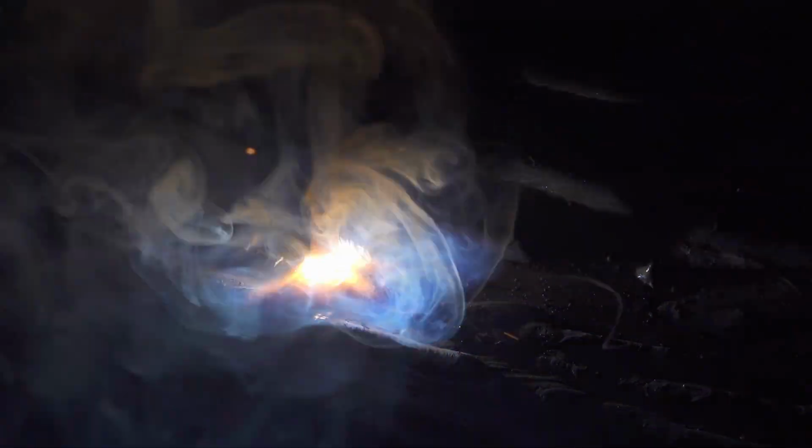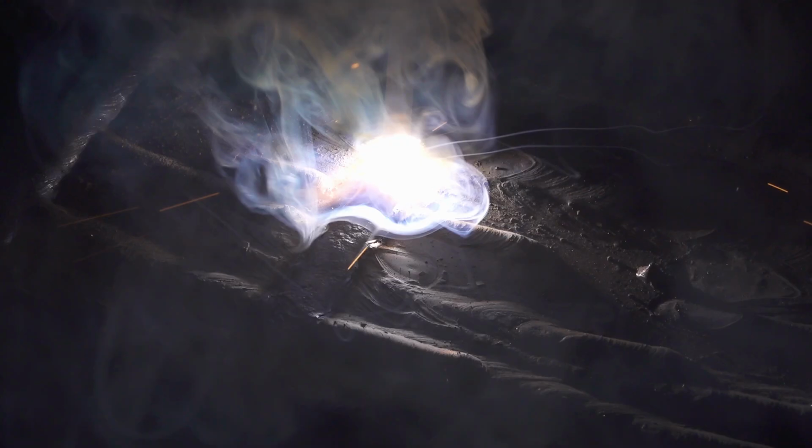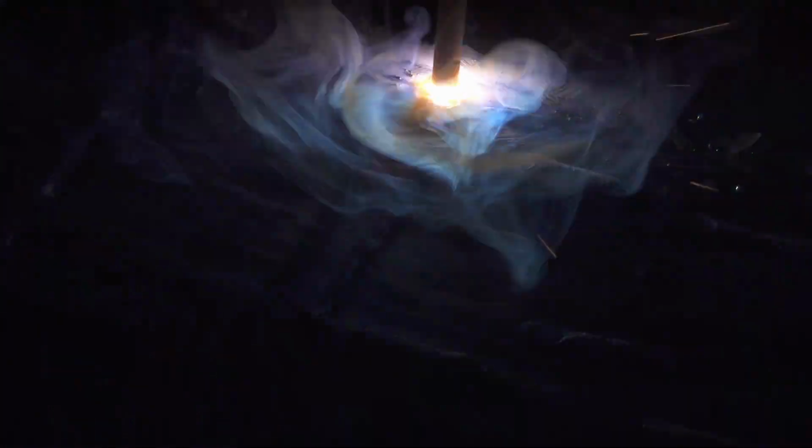I'd line up to scratch the rod, and the arc would just start. It took me by surprise the first couple of times, but it's nice once you get used to it. Don't get me wrong, it's not high frequency start or anything, but it just started so easy. When the amperage is dialed in with the 7018 rod, it runs so smooth it reminded me of running dual shield flux core in a MIG welder.